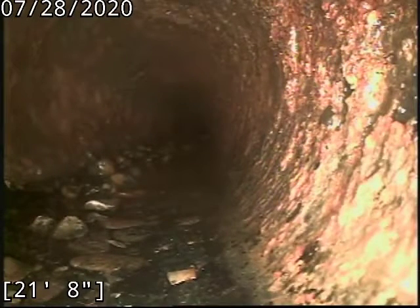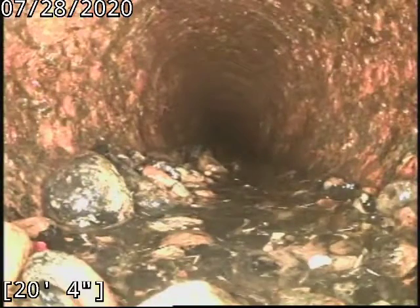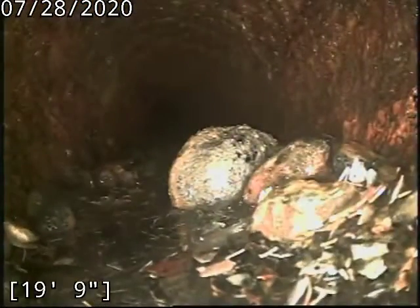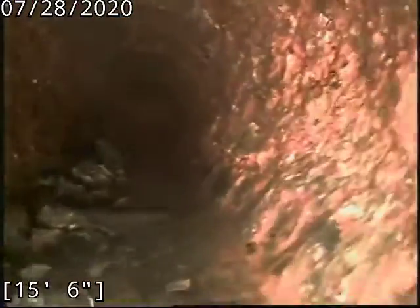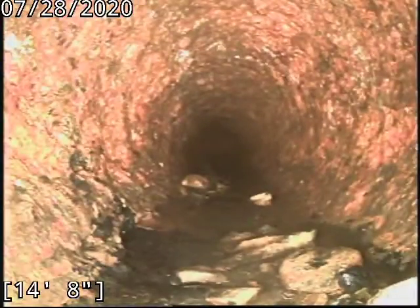Basically, the entire pipe under the floor has to be abandoned. You have no choice at this point. I mean, that's just gone. So, would it be that this pipe needs to be replaced, or can that not happen? Does it have to be rerouted? In theory you can abandon this entire pipe right here and put in a new one. To put in a new one, the floor has to come up. It just depends. By state code, you're required to have one floor drain in the basement, this one or the one in the front, as long as you leave one of the two.